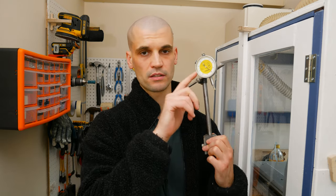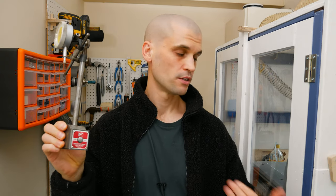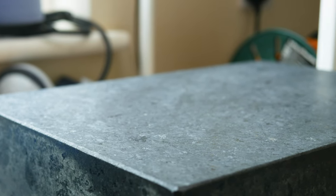A dial test indicator is also very useful — this is a plunger type on a magnetic base. A word of warning: I didn't realise that aluminium isn't magnetic, so the magnetic base was a complete waste of time on my aluminium-bed CNC. Don't get one that's magnetic if you can't stick it onto anything on the bed. To use dial test indicators properly, you want a granite surface plate — granite is preferred over cast iron as it's harder and more durable. In the UK I got mine secondhand for about £45. Reviews say it's very flat and it's a nice smooth clean surface.